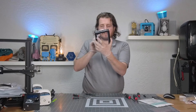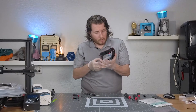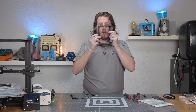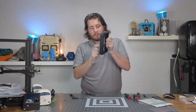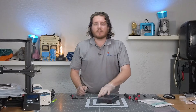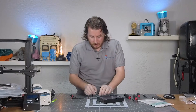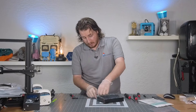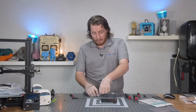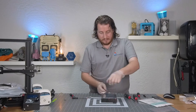When you're done, it should be reasonably smooth all the way around — you just want to make sure you can't tighten it too much more. This one might even be a little bit too tight, but I'm still going to send it. The last thing to do is use a sharp knife or an exacto blade — links in description, affiliate helps the channel out — and go through and just trim off the excess. Don't do like Grant did that one time: slip up, cut right through the FEP, and have to start right over again. That sucked. Don't do that.